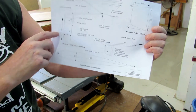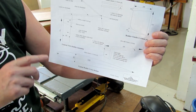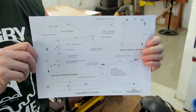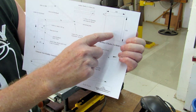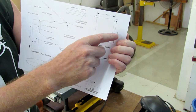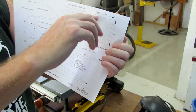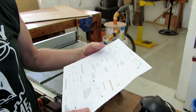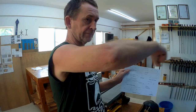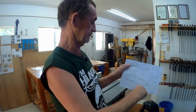The rudder board case — the cheeks are to be two by six millimeter, two by six on each side, so we'll have to laminate two pieces together for the cheeks. They're 200mm by 235mm, but there's an angle here and an angle here so that the tiller comes up at an angle.